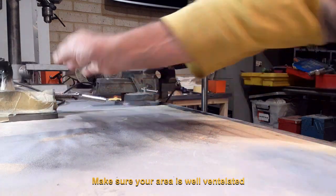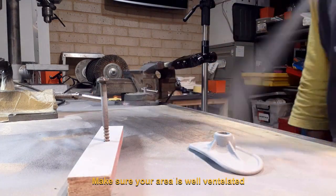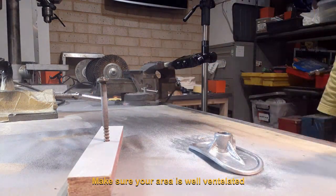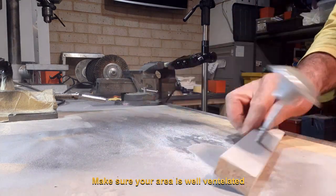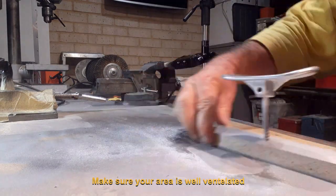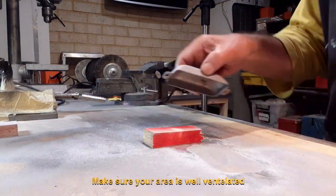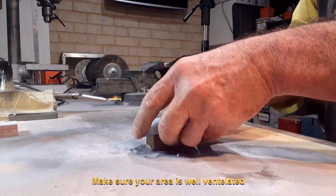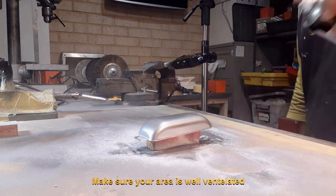Once the wet sanding has been completed and the piece dried and cleaned again, it is time for the final colour coats. In this case, I've used satin silver for the tool sides and breastplate, and automotive gloss black for the tool body and handle. The shafts have been left in their current polished state. Remember to use light coats and wait for the piece to flash off before applying subsequent coats.